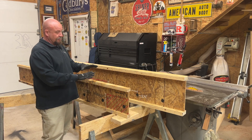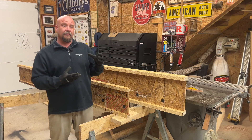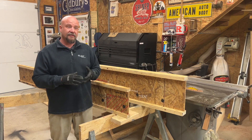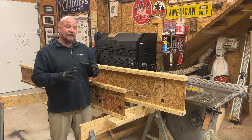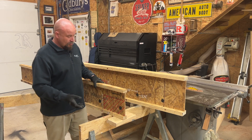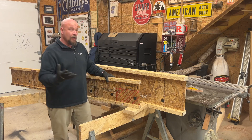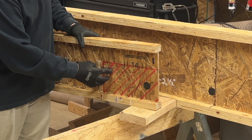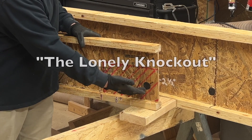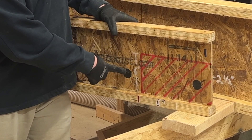One of the great things about the knockouts, other than being consistently spaced along the joist, is that they don't come into play when we start talking about adding additional holes. In all of our literature, the TJ-4000 states that the knockouts are excluded from any of the calculations within the I-Joist. So if we have this end bearing here in the hatched area and needed a one-inch hole, a lot of times we see somebody who just drilled right up in this area, not realizing we've already given you the marked spot — and moving over 12 inches apart, you could also go through here.